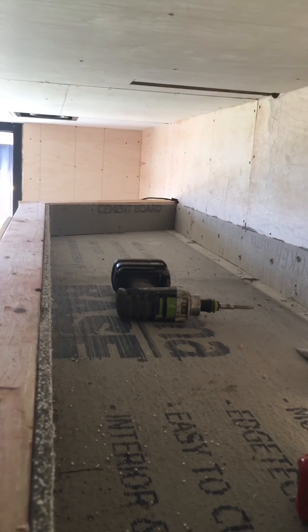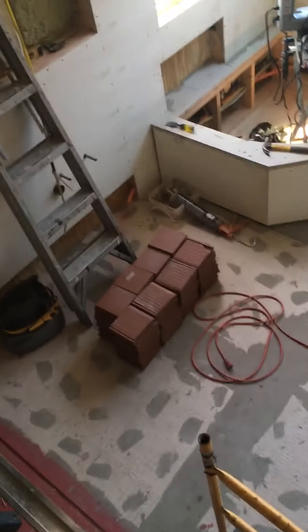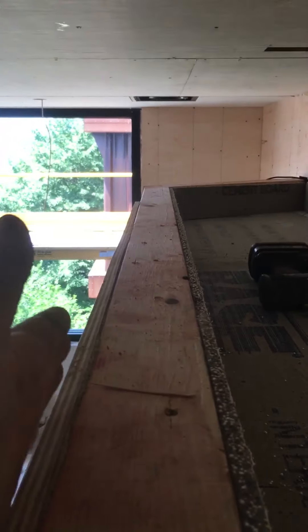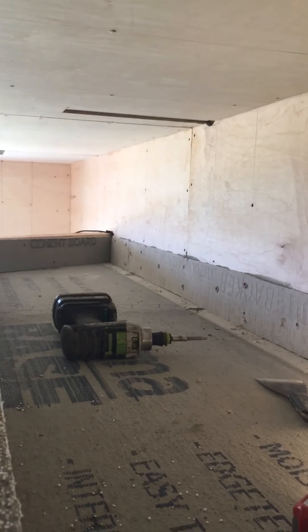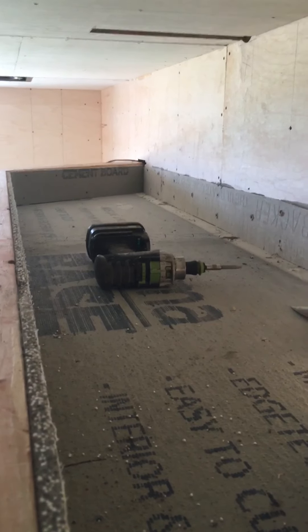We got them down there — we've got some coves and some regular field tiles. We're going to run the coves along the edges and run the field tiles in the middle, then cap it off when the teak comes up. We'll cap with the quarry and then grout it — we'll probably use epoxy because it's such a wet area. But first we're going to come and mesh everything.